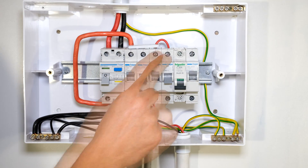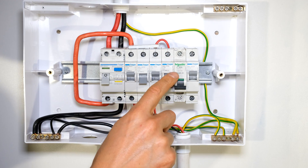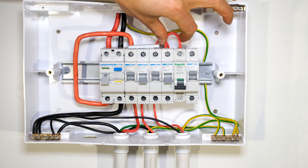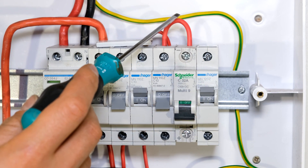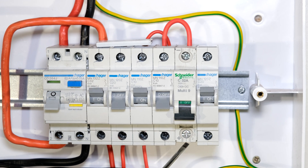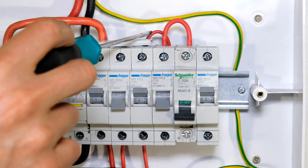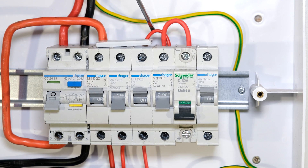The problem comes in when somebody adds another circuit breaker, and possibly even another. What happens is they tend to connect the jumper from there to there, and then there to there. This circuit breaker over here is 32 amps, so ideally I must use at least a 4 millimeter conductor — but right there I'm making a fundamental error. This conductor can definitely handle more than 32 amps, so if I connected a boiler or a geyser to the circuit breaker, yes, this conductor would be fine.